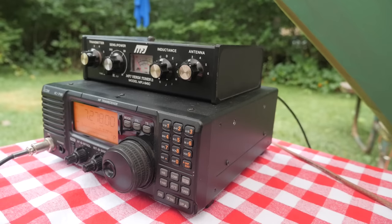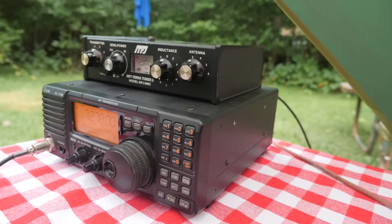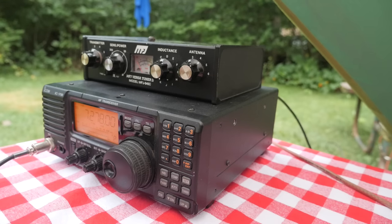It's working here to be able to do this for emergency communication. There's about 15 to 20 minutes to get that set up here, and it's a pretty good setup the way it is — getting across the state. Because the 40-meter antenna is only about 38 feet on a leg, it's not unwieldy to get set up. It can fit into most spaces compactly, and I was able to use a tuner to get it down to 75 meters, so it makes an excellent 75-meter NVIS antenna too.